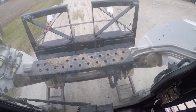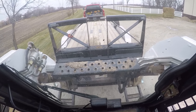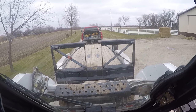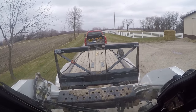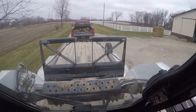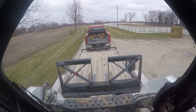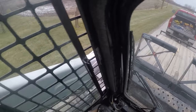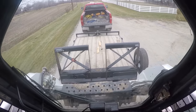What I do is crawl up on the trailer and start curling the loader forward so the weight is hanging out over the trailer. Then as I come up onto the trailer I just pick it up so it doesn't gouge the deck. You want to make sure you're as centered as possible for trailer tire wear.